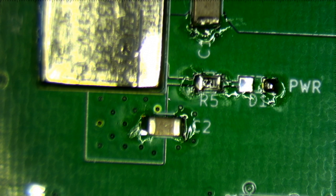Yeah, I know. 10 milliamps is a lot, especially with modern diodes. When I grew up, 15 milliamps was the standard because you had those awful, huge red LEDs. I found that you could power them with as little as 500 microamps now. But I looked at the specs on this one, and it seemed to want 10 milliamps. So go figure. Okay, green LEDs.